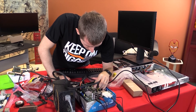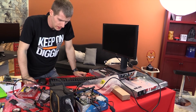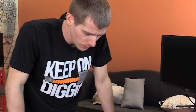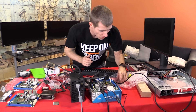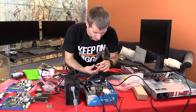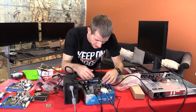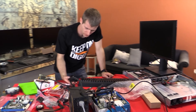Let's try a different CPU. I've got a 3570K from the CPU pile. The weird thing is with the other chip I wasn't getting any beep codes, and it was warming up and actually getting power. This time it's failing POST. New plan: it's quite possible that even though they're on the same socket, this motherboard doesn't actually support the 3000 series processor, so I grabbed a 2600 and we're going to take this baby for a spin. Still no power to the peripherals.